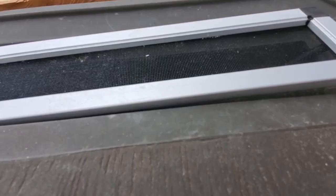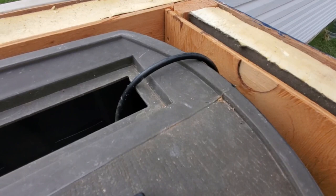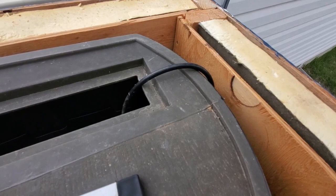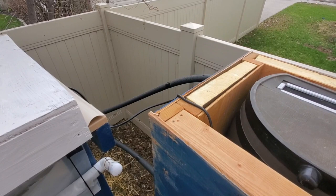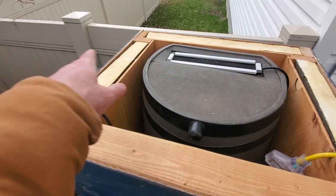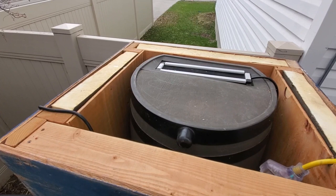I fill it up when it gets down to about a quarter to a half full because I never want it to run out. So when it circulates at nine degrees below zero, the water leaving this tank is about five degrees above freezing, which helps keep the system from freezing up. It also keeps pressure in the lines, which makes it easier for the birds to get their water. That's the automatic watering system — now I'll show you how the animals access the water.